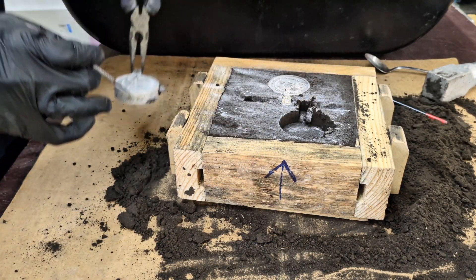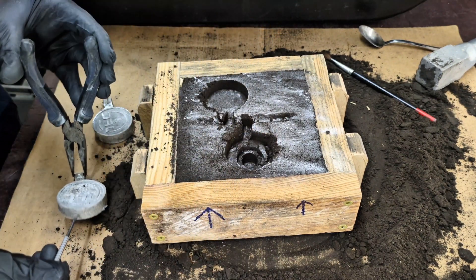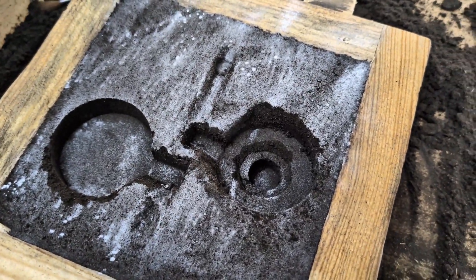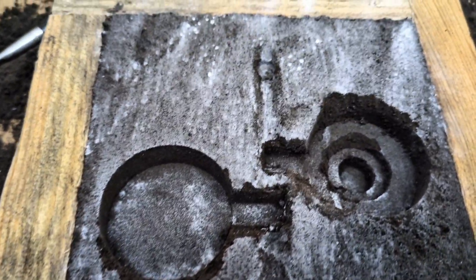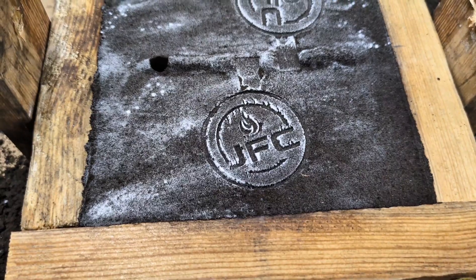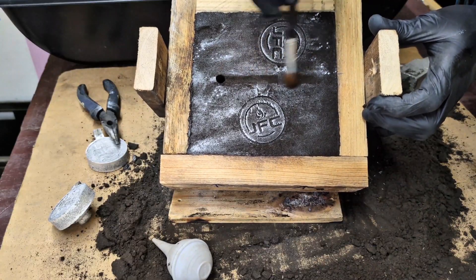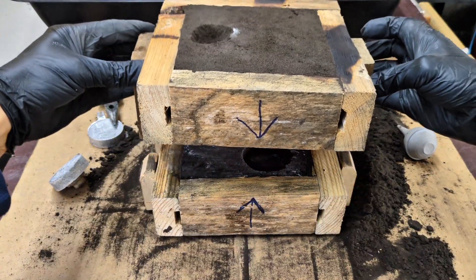Now these patterns were not tapered, so unfortunately they are pulling some of the sand out with the pattern. I will try to fix a little bit, but it doesn't really work exactly as I planned. It just means I'm going to have a lot more flashing to file off of the final cast. But the main thing is the face of the pattern and it looks perfect. And now I'm going to scrape away that extra area of sand carved into the bottom of the flask, which was the runner, out of the top.